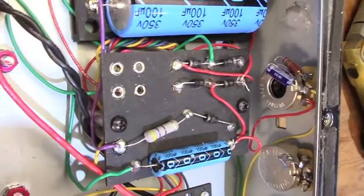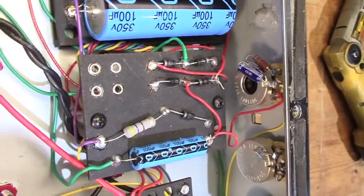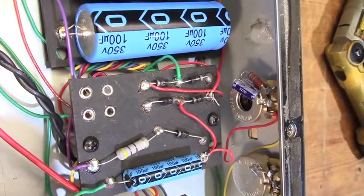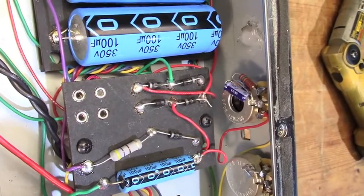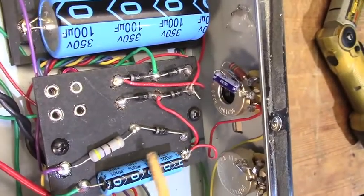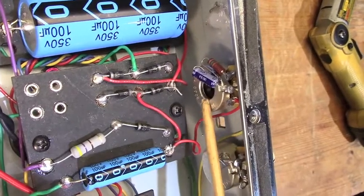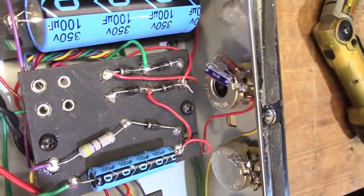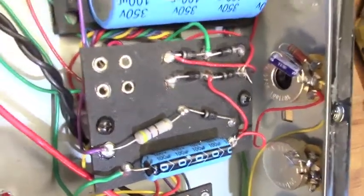That was really the only stumbling block that we encountered when I was building the amplifier out. Initially I started building it with the old school rectifier supply, and it didn't work at all, and I sat down and had a peek at it, and that's exactly what was going on. You'll notice right there, my bias supply is right here on the board like it would have been on a Fender, and here's my bias potentiometer, which, like I said, is there because it's a good place for it. It's real convenient, it's handy. Even if I had drilled a hole forward for it, it still would have been in a really inconvenient place. So that's where it ended up.